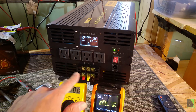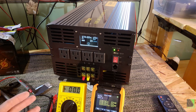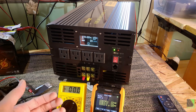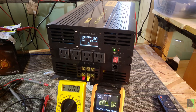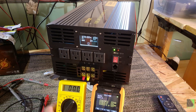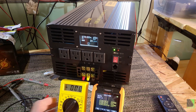So it's no surprise that if you start poking around inside the inverter and on these terminals, you will get odd voltage readings. Some meters pick them up, some meters don't — you may get different readouts. An oscilloscope can be helpful in determining what you're seeing, but in this case I just have these two meters, and you can see how this sophisticated meter acts totally differently than the basic one. This meter also costs a lot more. You can see how much more sensitive it is — picking up all kinds of stuff in the millivolt range — while the basic one just sits there on the 200-volt range. I'm not saying you have to go out and buy an expensive meter; this type works just fine if you know what you're doing and you're aware of the pitfalls.